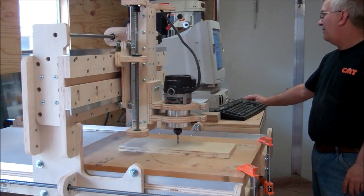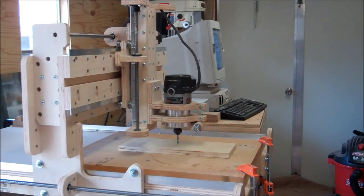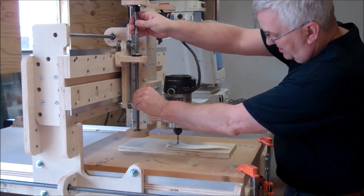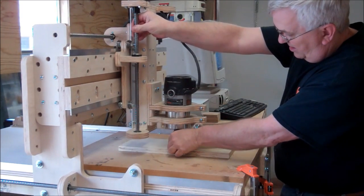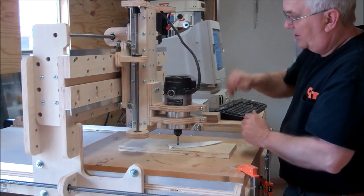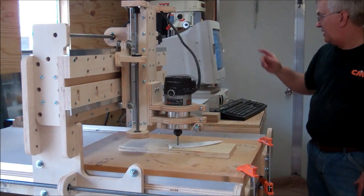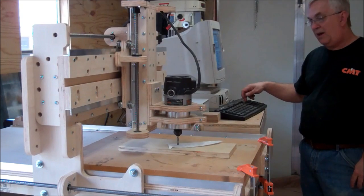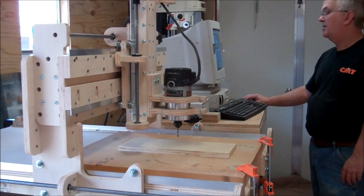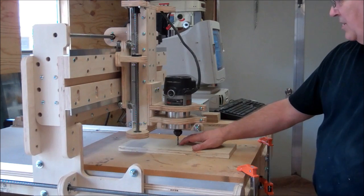Now I'm going to hit 'Reference All Home,' which turns everything to zeros. Then I take a piece of paper and turn the controller off to free up the motor — you can hear the motor unlock. I spin the bit down until it's just starting to grab the paper. Now I make sure to turn the controller back on and power it back up. I check my display and everything is still at zero. I hit page up, pull the paper out, come back and hit 'Go to Zero,' and double-check: I'm at X zero, Y zero, Z zero — exactly where I want to be, right in the middle of the machine.